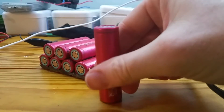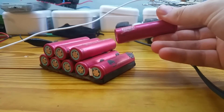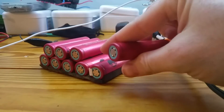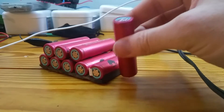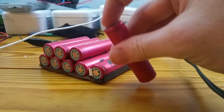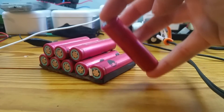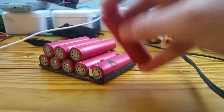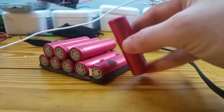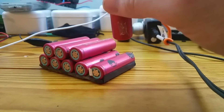So you went and got a whole bunch of battery packs, laptop packs, and you just rip them apart and pull these out. The next thing you need to do: grab your multimeter and test them. If it reads a volt or two, set it aside and put it in a box to be charged. If it's in the millivolts, or if the voltage on the multimeter reads negative, put it in the box to be recycled. If you connect it and it goes to zero volts, recycle it.